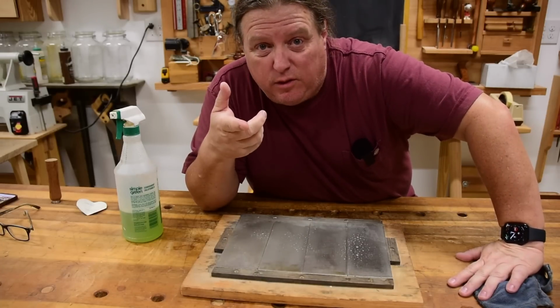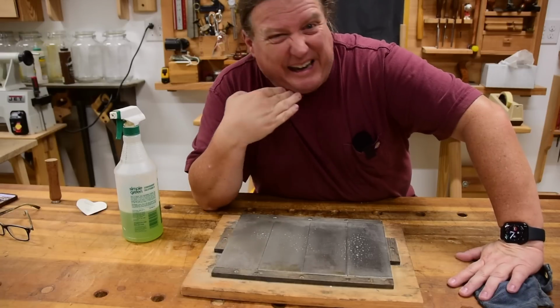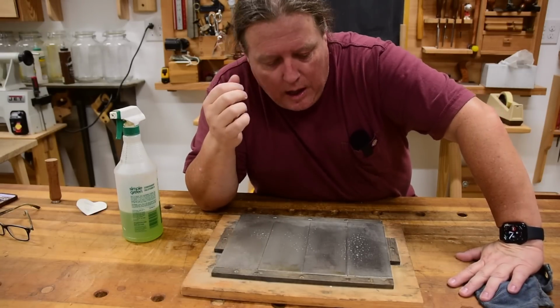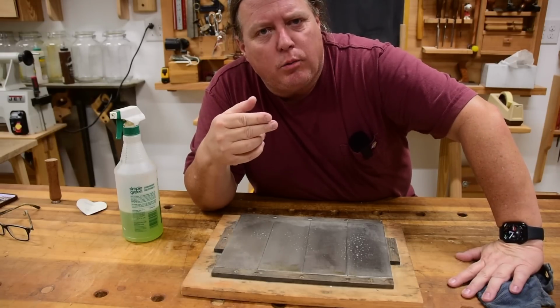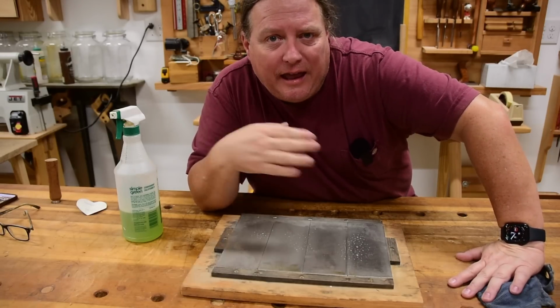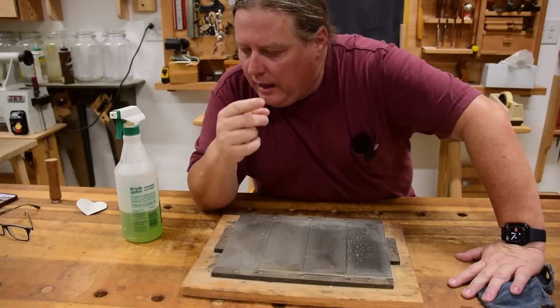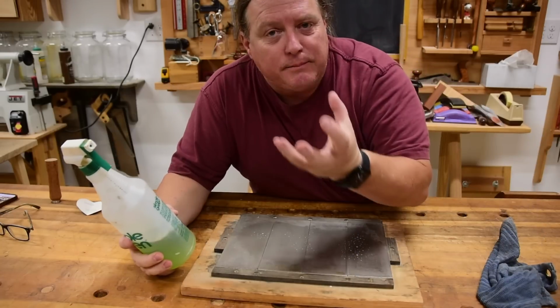And that's especially if you're using soft metals like brass and stuff like that, which I would never recommend. That's what a mill file is for. You can clean those out. But even with oil stones, people I know will use kerosene or something like that as a little kind of flushing of the swarf away. And the idea is you don't want to use water, because water has some tension to it.